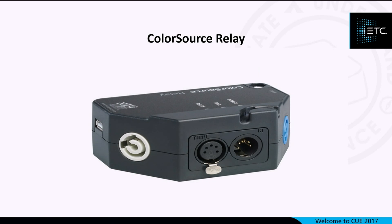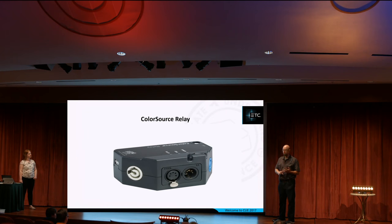And then lastly, we have the wired version where you can just set a DMX cable in, DMX cable out. Basically what this allows you to do is, where you don't need wireless DMX, you can still introduce power control to a system. So say you have a black box where you want to be able to adjust where your lighting positions are and make an extremely flexible system from show to show, and you want to be able to put your relay circuits wherever you want them to be instead of having to hardwire a relay panel in, this is a great way of doing that and allowing you to have a tremendous amount of flexibility in your space from show to show.